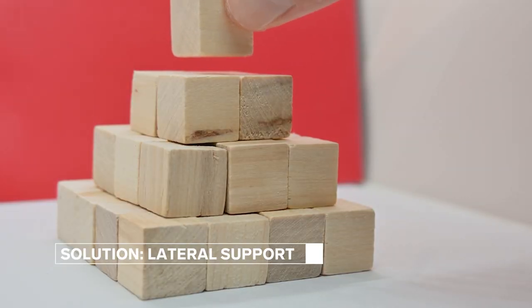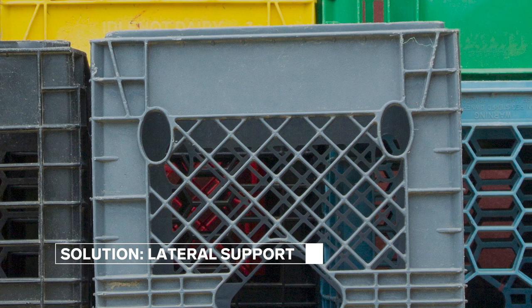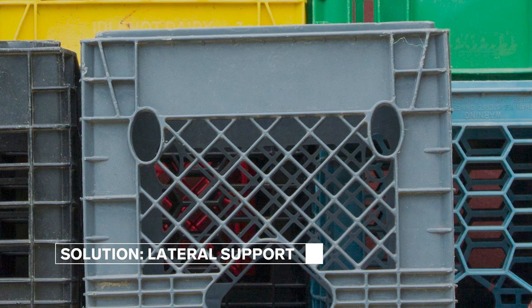There are a couple of ways that if I had to build this and make it structurally sound, I would find a way to attach each crate to each other with adhesive or something to make it act as one unified column. Another thing I would do is create lateral support — probably have several rows of crates so that when one begins to sway it can distribute the load to the others.